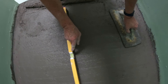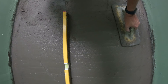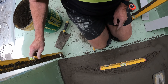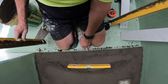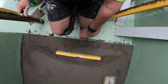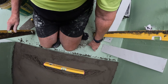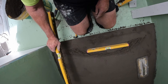We're falling nicely — see that, that's just about level with the concrete floor. So I'm flush with the aluminium there and down a bit there. That is purely a water stop, but that's where I'll be starting my full tile and running down there. I'll be going off here with a full tile, I'll probably miter one tile out here so it fits together nicely and covers that aluminium.